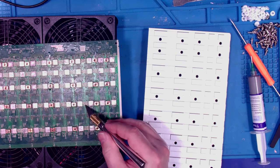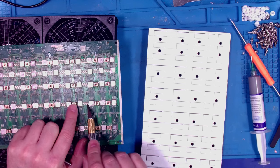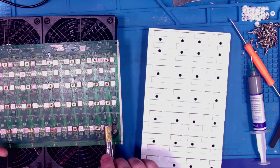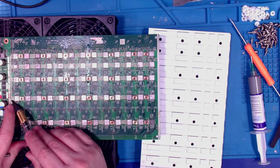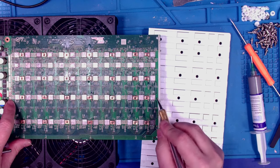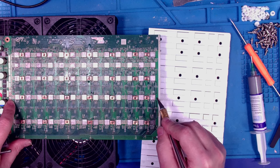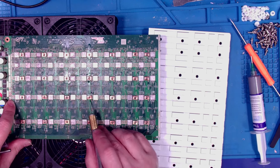these are your power rails, right? So if you were to measure across here, I think you get about a 1.8 volt drop across each of these. If you were to measure from all the way here, where those little guys are, all the way to this right here, you would get like 24 volts. Okay? 21 to 24 volts, somewhere in there. And that it steps down.